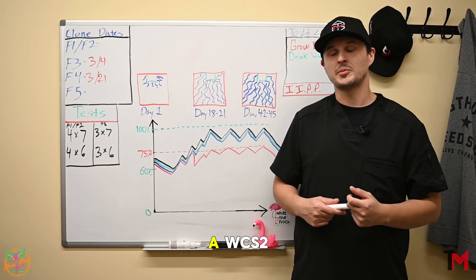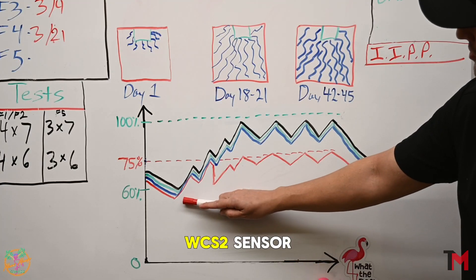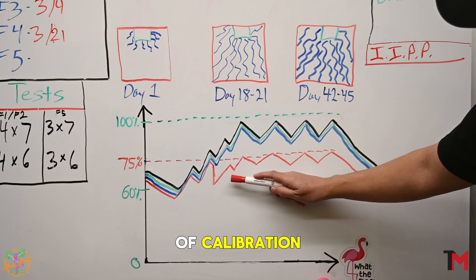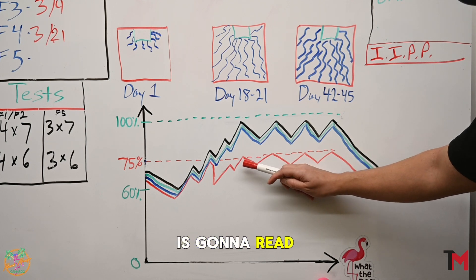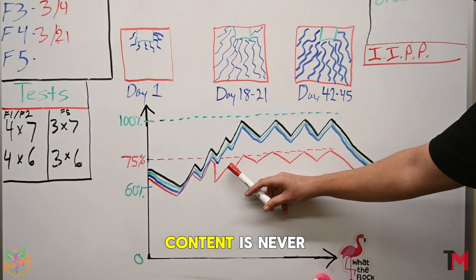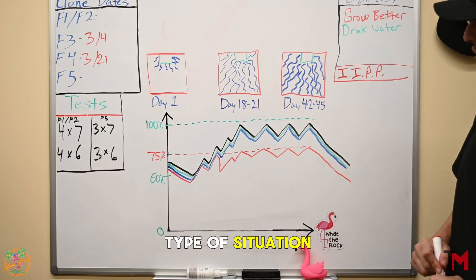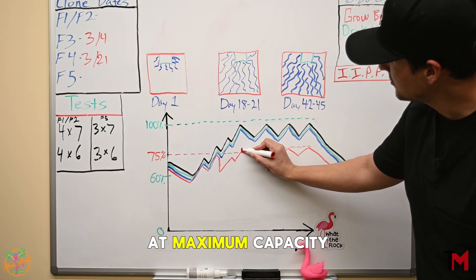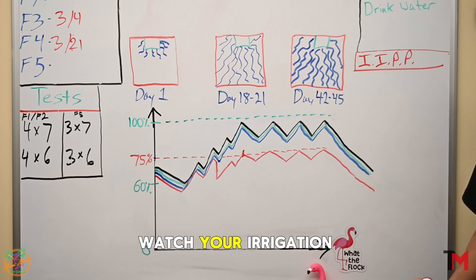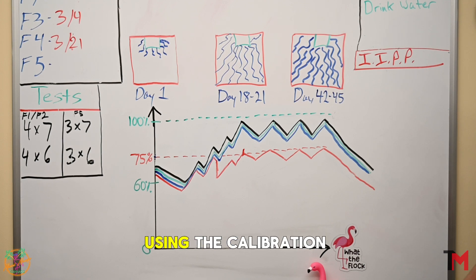Here I have a chart that represents a WCS2 falling out of calibration. As you can see on our red WCS2 sensor, we've fallen out of calibration at the second P1 event. Upon falling out of calibration, the new maximum capacity for this block is going to read at 75%. You can make the mistake of chasing your tail here, because this water content is never going to reach back to the initial 100% you calibrated with. To remedy this, you're going to want to recalibrate your sensor at maximum capacity. Watch your irrigation events and figure out where you're achieving runoff, then recalibrate back to 100% using the calibration feature.